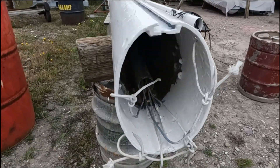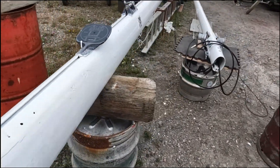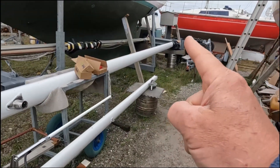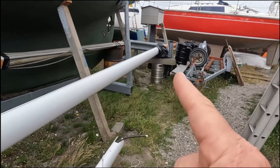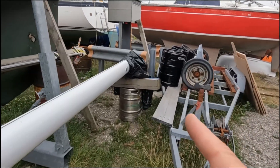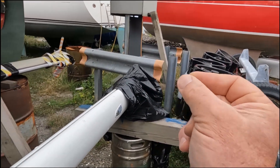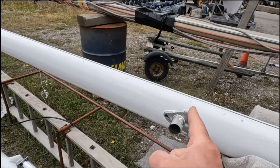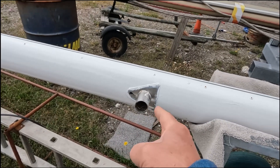The challenge with the main mast is that the tube already fixed in the mast — a metal tube — doesn't seem like it's going to be big enough for all the cables we need to run. We've obviously got three antenna cables: two coming to the spreaders and one to the top of the mast. We also need deck lights, a steaming light, and we've got a combination LED light for the top of the mast with an all-round white and a tricolour, needing only one thin cable. I'm therefore thinking we'll probably end up running an extra duct just as far as the spreaders, rivet that in, and use it for the mobile phone antennas.